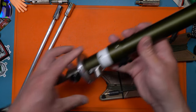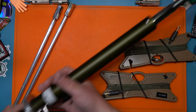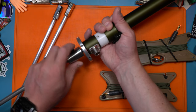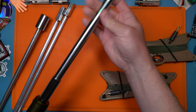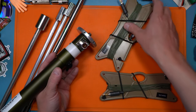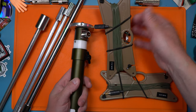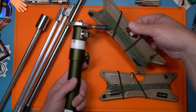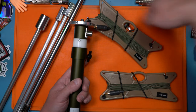A couple of things that jumped right out at me: I really like the radial plate design because it's really simple. Before, you had to screw something underneath this little guy beforehand, then drag out your radials and all that. In this case it's really simple — you just get the vertical set up, then grab your little banana plugs and shove them in here. They are a bit tight, but you want it a bit tight. Then you loosen up this elastic string and just walk out the radials. In fact, I rewound some of these into a Y configuration — which doesn't work.